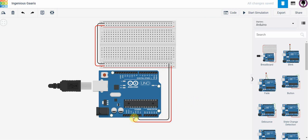Notice here that they used red wires, and they've fed them around here like this so that the wire's not covering anything on the UNO board. I'm going to make sure we're not covering up things. Try to make it so you can read all of these here, because these are very important, and these are very important down here. Notice they wired this around here to the negative terminal or the ground side of the board, and the positive power rail they've wired like this. They've used red wires for the positive power rail and black for the ground or negative terminal. Please follow that same notation when you're building. Wire colors are important. If we have enough wire colors, you should use the right ones.